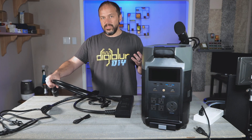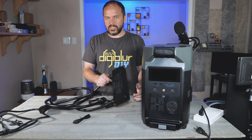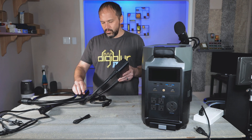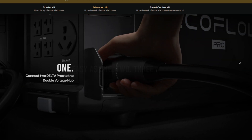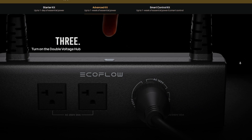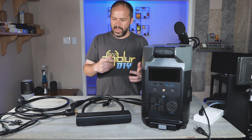The way you have to do that in the US is you need to put both batteries together and it kind of changes the phase — I'm assuming that's what happens in this box — and that way you do get 240 volts. I'll be showing this on a power inlet, similar to a gas generator inlet, where you can connect it up. Of course, you just don't have all that noise of the gas generator running, but you're going to get lower run time and it's not as easy to just go fill it back up.